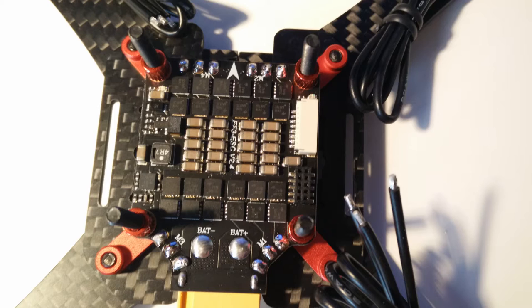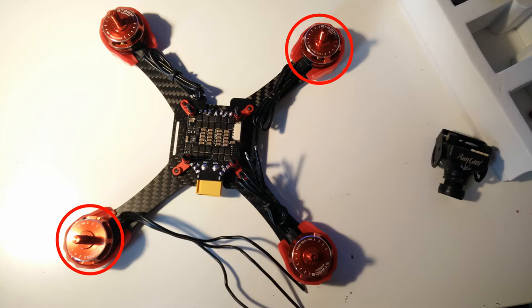You want to go ahead and tin your pads as you'll see I've done here — tin each motor pad. When you're putting the motors on, they are all identical. It doesn't matter which is counterclockwise or clockwise, but you want to swap two of the wires over when soldering up on two of the motors. Solder the other two up normally, one wire to each channel in the row of three, but on those two motors swap one of the wires and keep the third where it should be on the end — that changes the motor direction so your drone will be able to lift off.